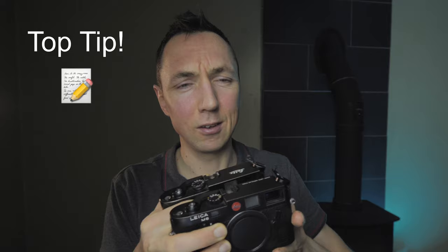Both cameras have the quick film rewind mechanism. A useful tip: if you want to know whether a camera has film loaded, lift the rewind knob and try to turn it. If it doesn't move, there's film inside. This saves you opening the back and destroying your film. My M4P has film in it, so I'll use the M6 as the demonstration example.